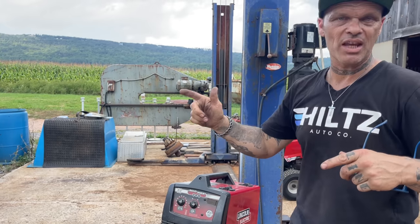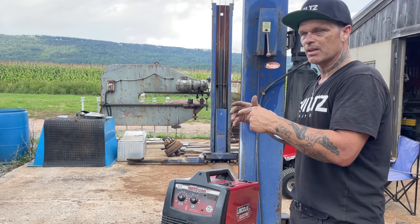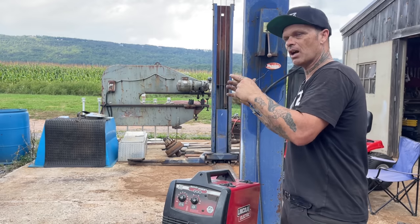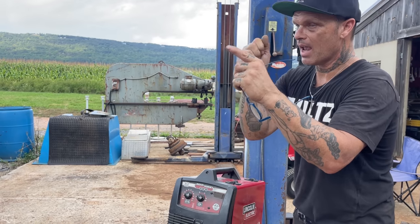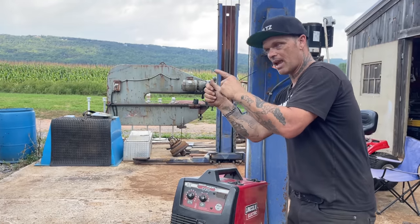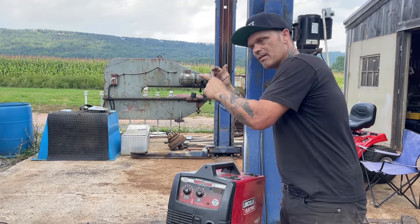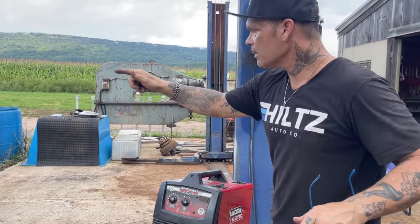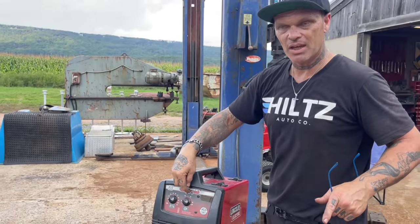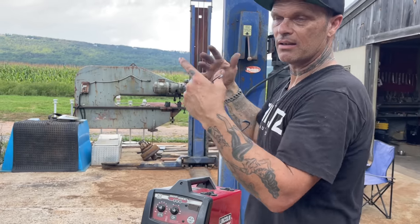1, 2, 3, and then I'm on the air. If you stick to that process and go 6 inches apart every time. So if I weld 1, 2, 3, air, 6 inches away, 1, 2, 3, air, 6 inches away, 1, 2, 3, air. I know that I'm penetrating, because I've got it on high heat, and I know I'm not going to warp it because I have the air with me to bring the heat down.